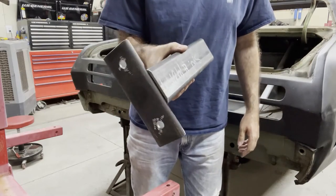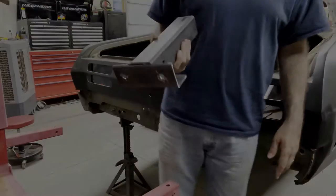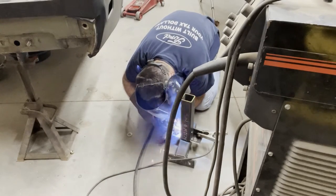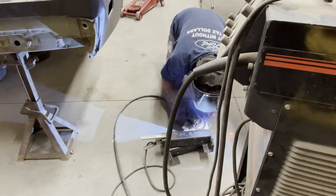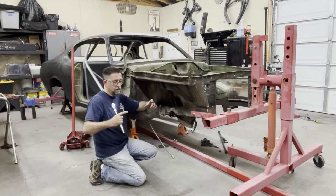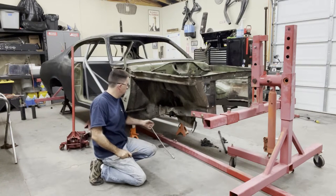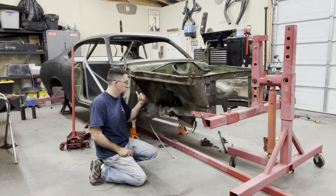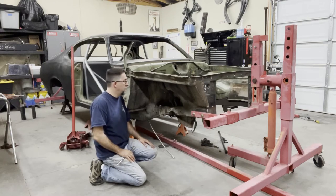So I just put a few small tacks on there. It's hard to see what I'm doing in there, so I'm going to put it out on the floor where I can actually see what I'm doing to weld it up solid. One of the components of the rotisserie is the center beam — it locks the two ends together so they don't blow out or move too much. I'm going to shorten it up, slip it in on this side. Once I get the other side bolted up after the brackets cool off, I'll assemble everything, double check all my bolts, make sure everything's tight, and then start raising it up.